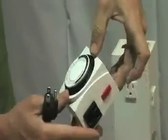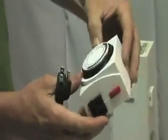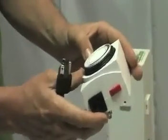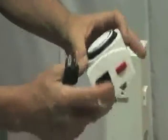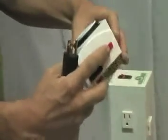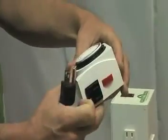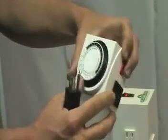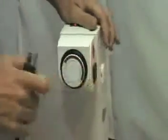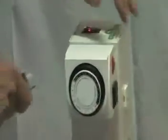Simply pushing the pins down represents on time. So if we wanted to have our light on for 12 hours, we would have them half on and half off. This red button — you want to keep it in the upright position; otherwise it is manual. So we're going to keep the red button in the upright position, plug our timer in, and keep everything off until we have our bulb in.